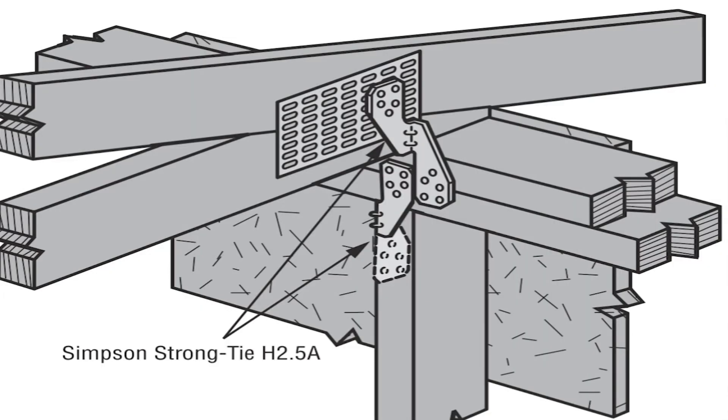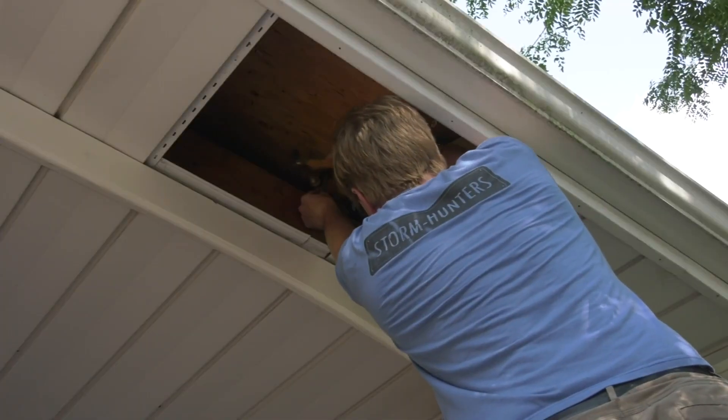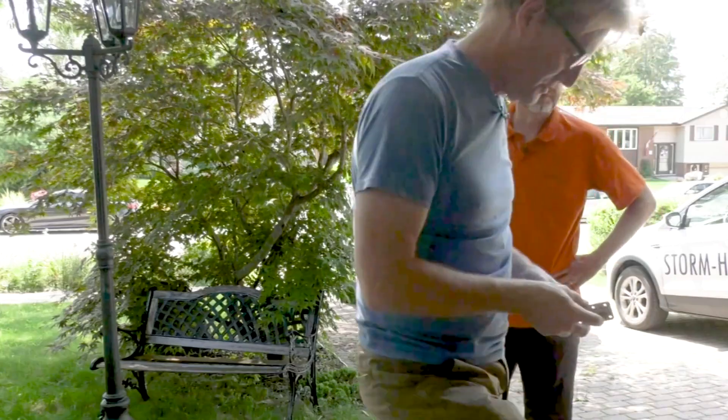What do we do here? The solution is actually pretty simple. They're called hurricane straps. You can get those parts at any hardware store and they're not expensive — you nail into the top plate and just put the nails in. I've got two types here that I picked up from the hardware store.